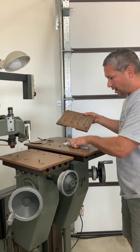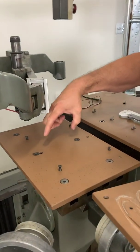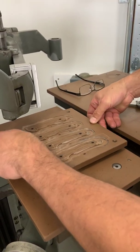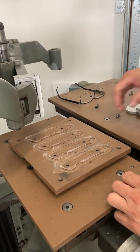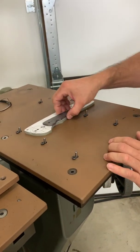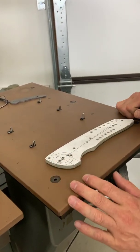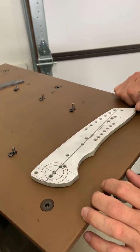So on this plate, you'll notice that there's four screws and two hardened pressed bushings. The hardened pressed bushings are for these locating pins that will go inside the bushings, and then the screws basically lock them down. On this side I have two locating pins — one is for the pivot hole, and one is for a tooling that's in the liners. I also have screws right here to hold down my template.